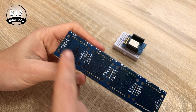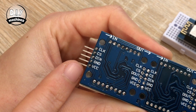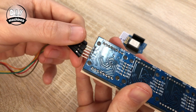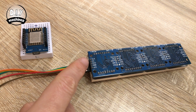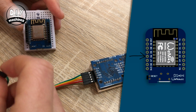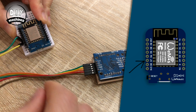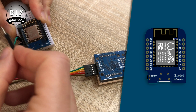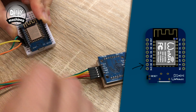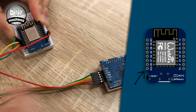If we take a look at our display module, you'll see on the back it should be marked with in and out, and one end marked with the names of the various connections. This is the end we'll want to connect to our breadboard. So take your five breadboarding wires and put the five female ends onto your board. The wire going from CLK — green in this case — wants to be connected to pin D6. Then the wire from CS — yellow — to D7. The wire from DIN to pin D8, ground to ground, and VCC to the 3.3 volts.